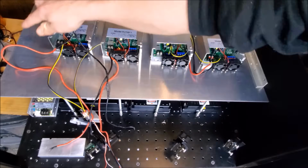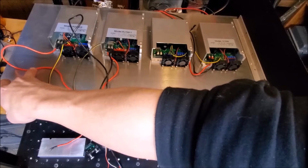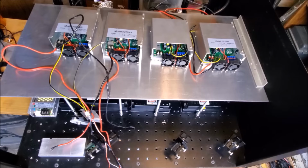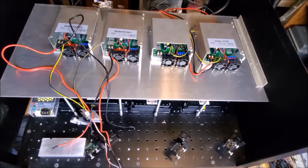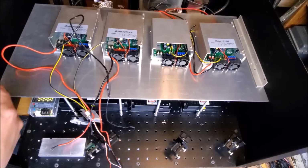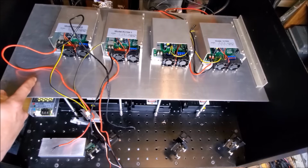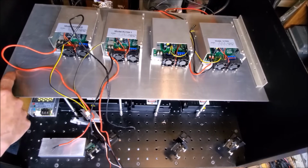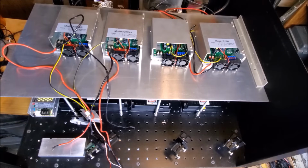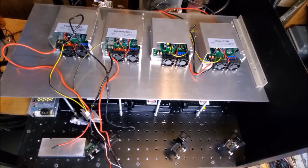And then another L channel on the side. I need to cut out a little bit of this corner here. I'll show you why. So on the inside of the laser, there are fans, and I need to make clearance for that. So that fits on. You can see where that hits. So probably cut about 1.5 inches off this corner and out a couple more inches. You know, probably do a diagonal cut here. Be the easiest and probably look the best. So that's my plan. At this point, time to drill and tap some more holes.